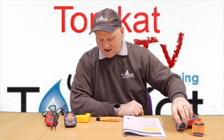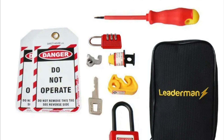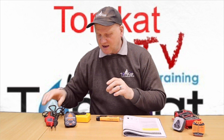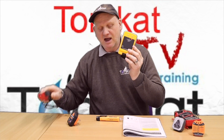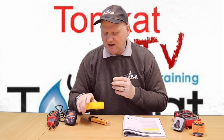You will also need a lockout or lock-off kit for electrical consumer units that have MCBs or RCDs, and for fuse spurs or isolator switches. So the major components we need are: the two-pole tester, a socket tester for live/neutral/earth polarity and earth loop impedance, a proving unit to prove the two-pole tester, and a known supply can also be used to verify the non-contact indicator.